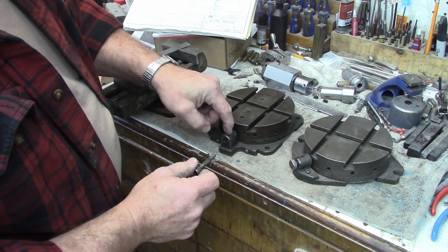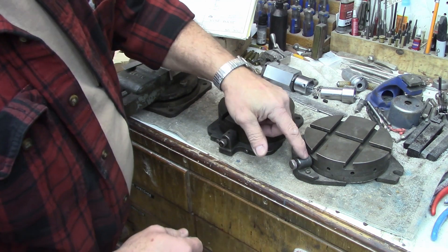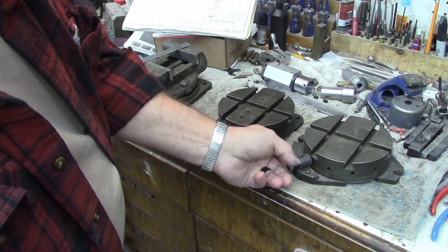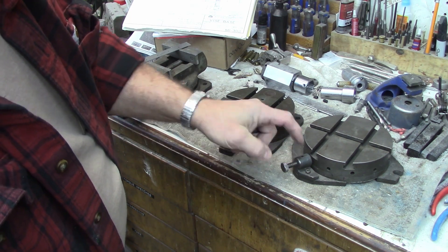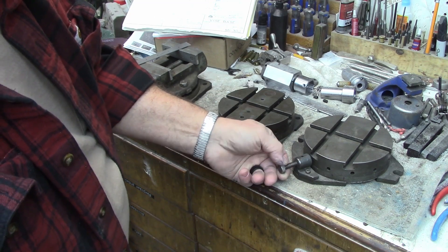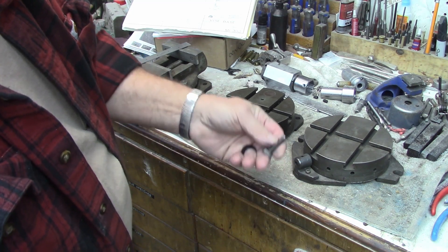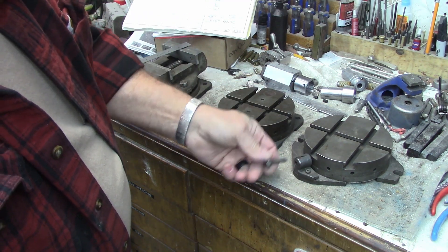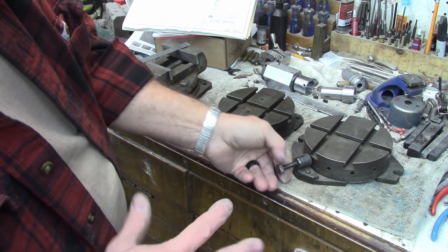Both of these have the holes drilled through for that spring and detent ball. The one on the milling machine rotary table is actually threaded — it's threaded quarter-twenty — and it threads in to lock. I don't know if they did that for a reason or if this one's been modified. I just noticed that yesterday when I was looking these over. This one is more convenient; this one is probably a little more positive in its locking. It still has the same hole drilled all the way through so it will have a detent ball and spring. Those are the only differences I see in the mounting, but I'm not sure what's proper and what's not.